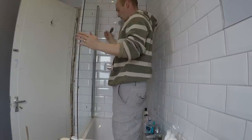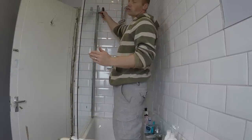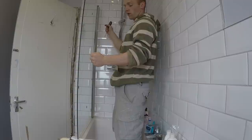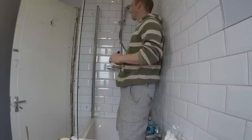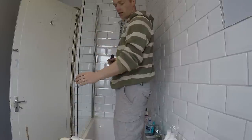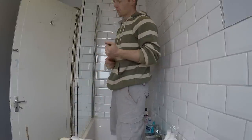I'm hoping that it's going to stay vertical now. Otherwise, if you had a wonky wall, you'd put the top one in and then tweak the door until it was perfectly vertical and then mark up and drill those. But we'll double check again with the spirit level, send in those last two, and then that'll be it fixed in.